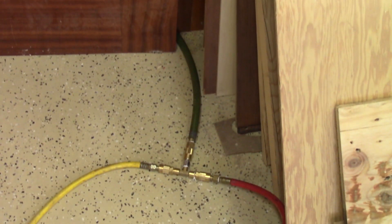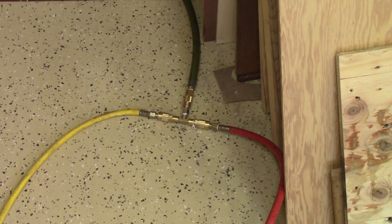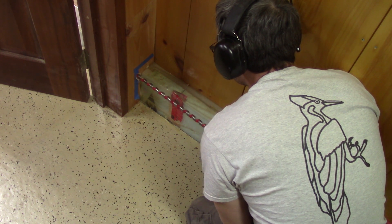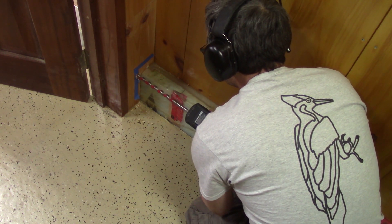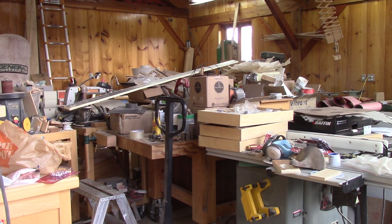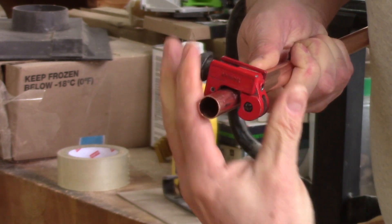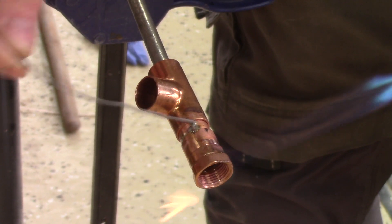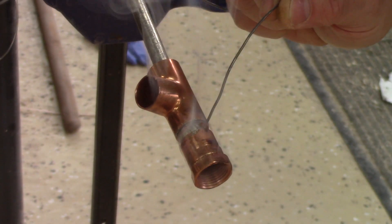But this is another problem. Since my new CNC has been up and running, the door to the compressor chamber is always open to bring the air to the CNC. So I'm going to install permanent pipes. The first thing I have to do is drill through the wall — if only it was this easy. I had to move my miter station from the wall. This is what the shop looks like now. Just that took me several hours. To carry the air, I will use copper water pipes. I spent a good part of the day soldering the pipes for all the outputs I want to have in the shop.